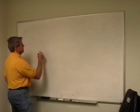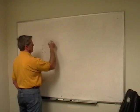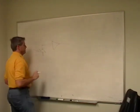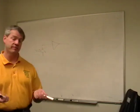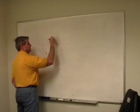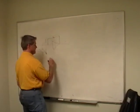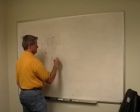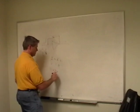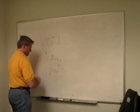But that's interesting, right? So now I can take a diode, and I can hook a diode up to an amplifier of some sort, and I can get a signal out, right? So I can just take a regular old, any kind of diode. Light emitting diodes are pretty good at it. They're kind of frequency selective, but this current goes through here, and I get amplification. This is called a transimpedance amplifier because I get I in gives some gain V out, so V over I is equal to R, right? Because V equals IR, and maybe I got it backwards. You get V per I, I'm sorry. V per I and gain. So this is a transimpedance amplifier.